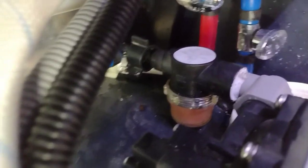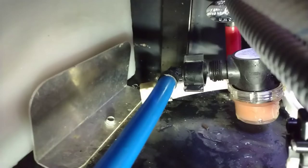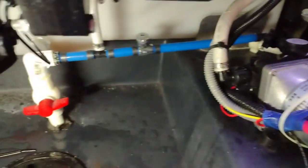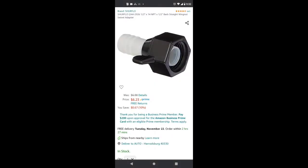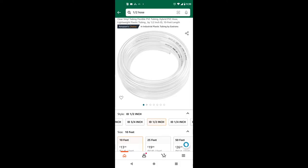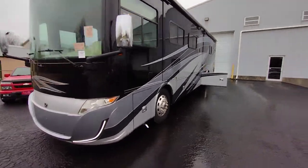You have accessibility to the water pump — you can remove that line with the bulb and connect a short hose that lets you pull antifreeze directly from the jug using your house water pump. I've attached links for the fitting and hose size you'll need to thread onto the water pump. Camco or Valterra actually makes a hose that directly fits on it.